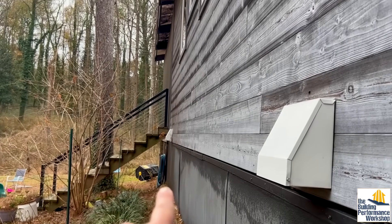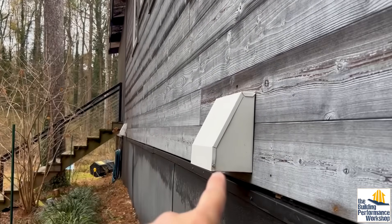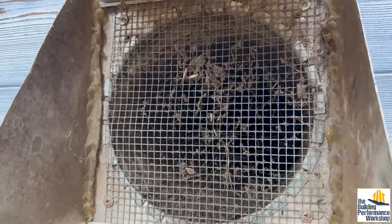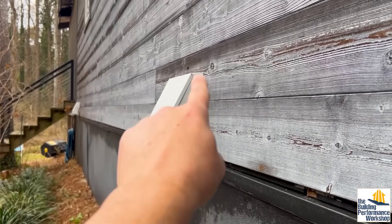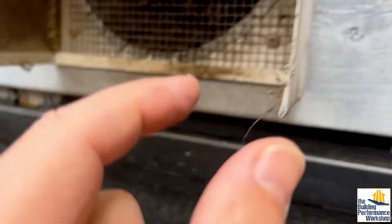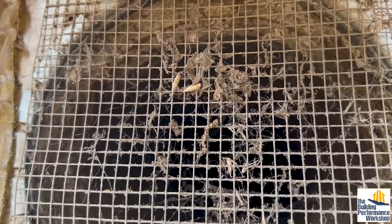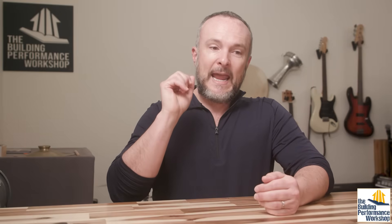Down there is the exhaust, paired with the kitchen exhaust. Here is the intake for the makeup air, which is not very dirty at all because it does not run 24/7. Here is the intake for the ERV. The hood we're using here is a Fantech hood — all you do is remove two screws and take this screen off and clean it. You can see all the dead bugs and critters on it, and then we're going to get at the inside. You generally want these intakes somewhere you can look at them regularly and somewhere accessible, because you will need to do what I'm about to do.